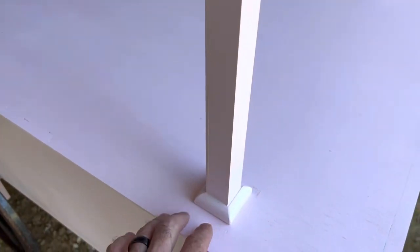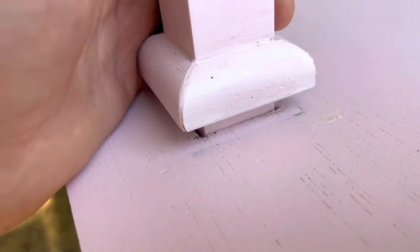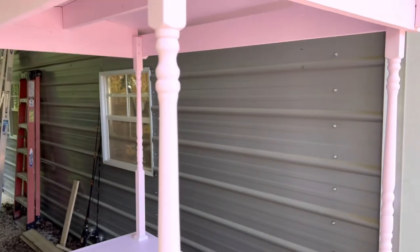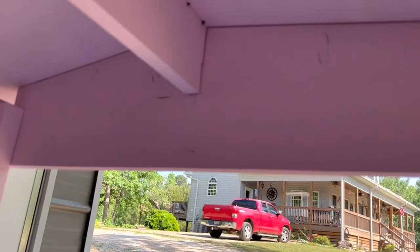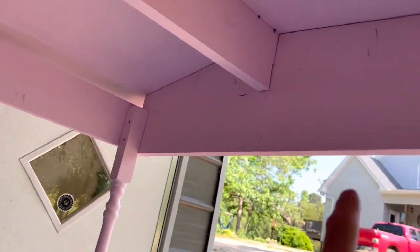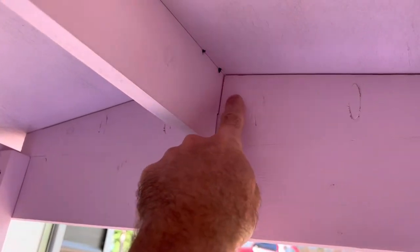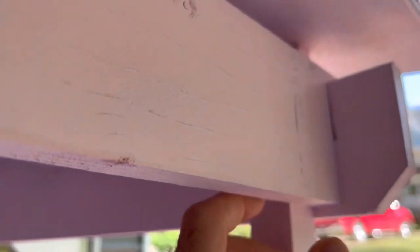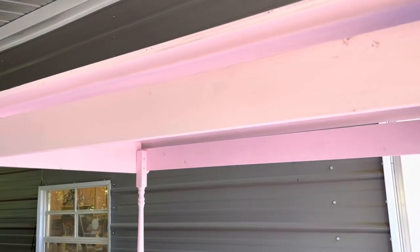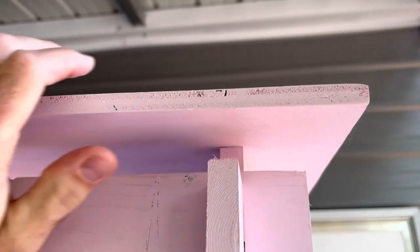The holes we were cutting earlier in the video are for the spindles to go into, and I just trim around them with shoe molding to cover up the hole. When you get ready to build this, put your spindles on the pieces we were making earlier — dimensions will be in the description. These are cut at a nine-degree angle for the roof, and all the slots are cut a little bit bigger than three-quarters of an inch so the top slides in easily with no screws or anything holding it. The roof is just hinged.